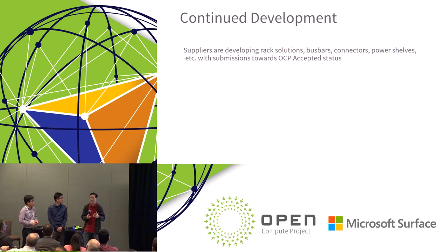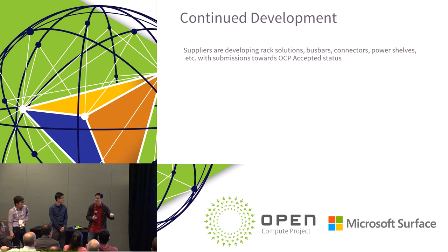From a process standpoint, we've tried to put the minimum amount of stuff in this specification, so what's required is really focused on interfaces. And then, as was alluded to, we've got a lot of different appendices related to specific products that can be built on those specifications, particularly around power shelves. You get a lot of different inputs and potentially different outputs, 12 volt or 48. But the main specification itself doesn't tell you how big the power shelf is, how much power is coming out of it, or how many rectifier modules there are. So we're hoping to fill out more of those appendices with very specific products that members of the community are interested in developing or using as we go forward.